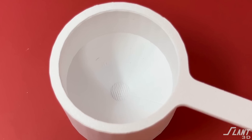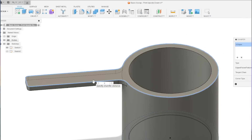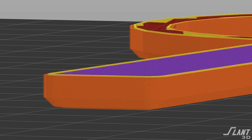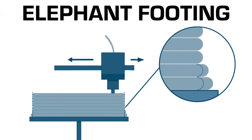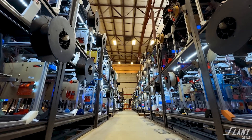Turning the scoop upside down and putting a chamfer in the bottom creates a very good product — it looks the same from the outside and functions the same on the inside. Additionally, apply a one millimeter chamfer to the bottom edge of the print. This ensures the first layer can't extrude sideways or inward, keeping edges crisp and clean, preventing elephant footing where the machine level or flow might be slightly off. This produces reliable parts at scale across tens or hundreds of thousands of prints.